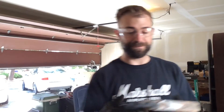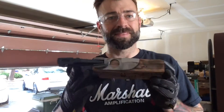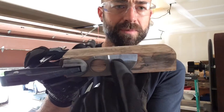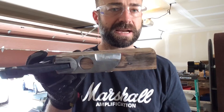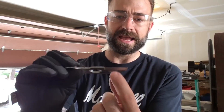Back on the jig, let's clean this up. I like that a lot better — it's a nice straight bevel. I'm going to give it a little bit more towards the middle because I could see it was bowing a bit and that's why it's not consistent. I'll take that bevel line up to the original one and flip it over and do the same thing. I've got my bevels in. I was planning on taking them up as far as the previous bevels were, but I'm going to leave it where it is because I'm going over the middle mark and I don't want to take too much of that edge away.